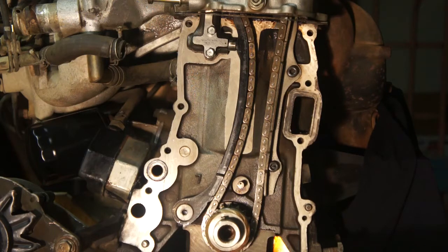This design stopped the chain noise at low RPM, but it did nothing to address the chain slack at startup. The 40F06 does not control chain slack at startup. The cause of startup rattle is uncontrolled chain slack just before oil pressure has had time to pressurize the engine.